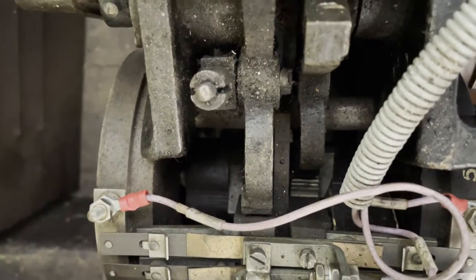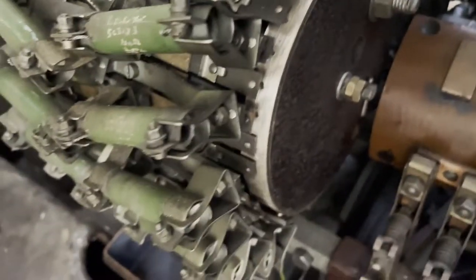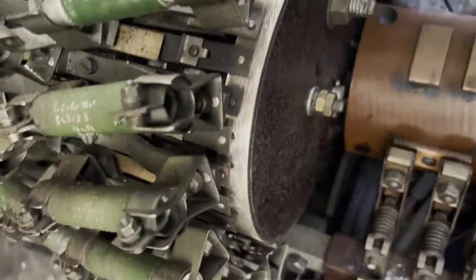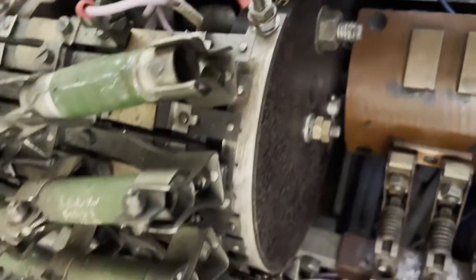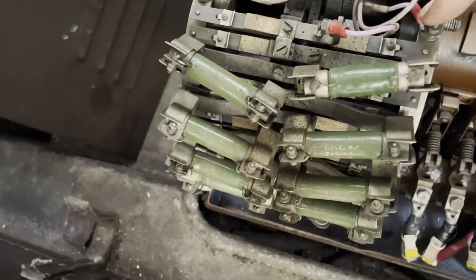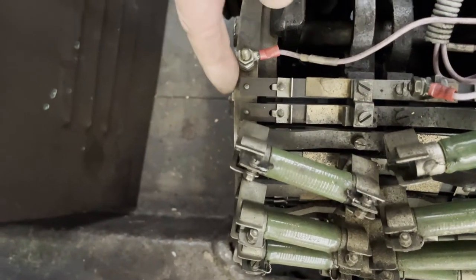For either direction, it also operates a rotating magnet, which — together with the magnet in the main unit — pulls different contacts as it goes round. Under running conditions this connects to one end of the motor, and that forms a full potentiometer divider rather than just a variable resistor. On the other side there is another potentiometer, but rather than being manually controlled, it is linked to a massive solenoid coil hidden away in the back.